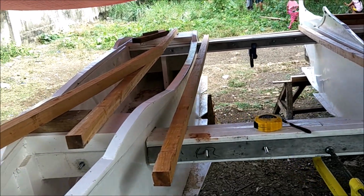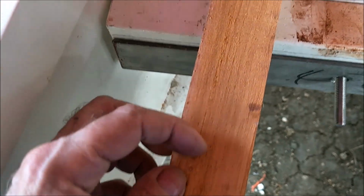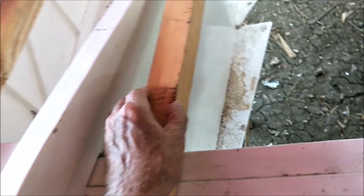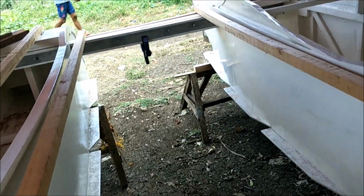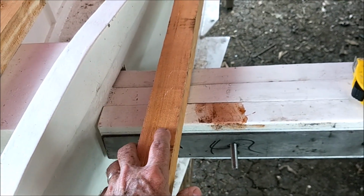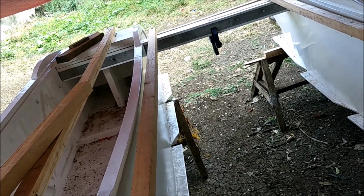Then after that, we're going to have to sand these things, because even though they were milled, they're still kind of rough. So you can see this rough stuff, and I think I told you before, the edges are really sharp edges. We're going to round those off with an angle grinder with a sanding disc, or a grinding disc. So we'll get all that cleaned up, and then we got an epoxy lacquer thinner mixture, and paint these with that, and then let that dry.